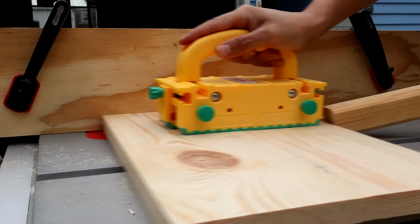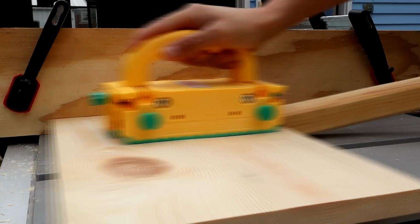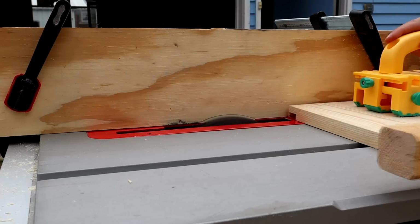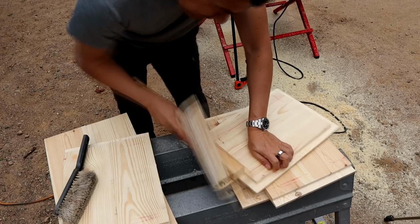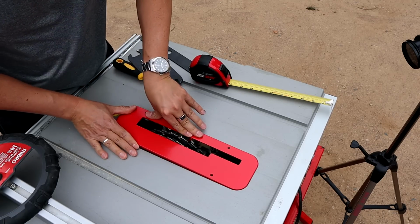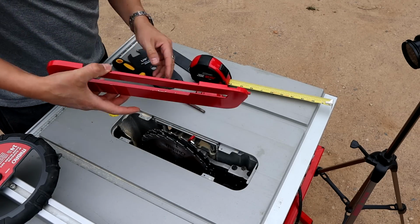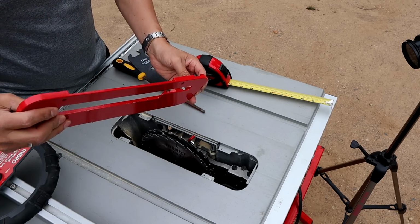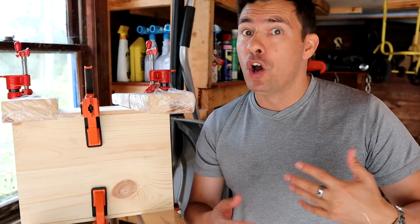But one thing I really appreciated is you broke out that terminology. I had no idea about rabbets and just the different cuts and how to use the dado blades. Walking me through was very, very useful because I still made a lot of mistakes. When I first put the dado blades on, they were too wide and they were actually touching the metal of the blade protector. So I cut it down a bit and went over with a few passes instead of just two, because I didn't think metal on metal was a good thing.